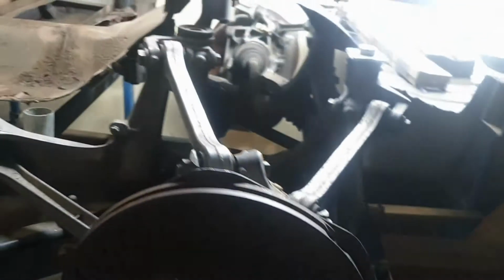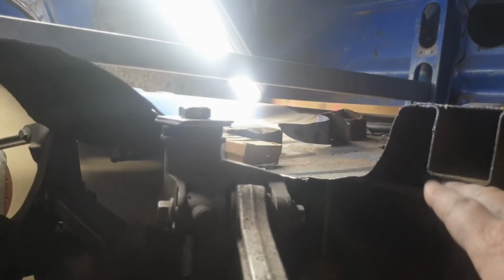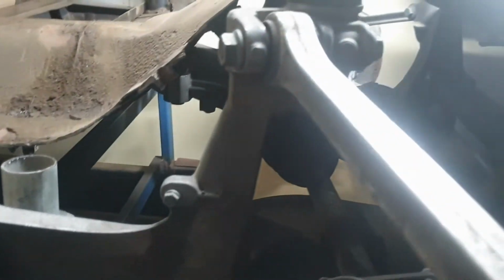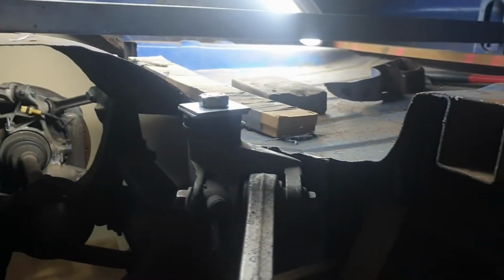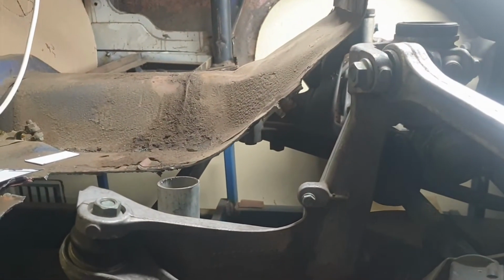So now our rear suspension is in its final position and we're ready to start to make up our chassis rails, which will come out from here across, pick up our 3 bolt holes. 1 bolt hole's over here, which I'm going to add an extension to so that the chassis rail can come across and clear this section when it turns to come down to pick up our chassis rail. So next step is some cardboard templates so that we can work out what we need in steel.